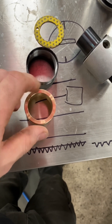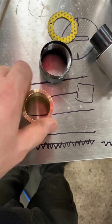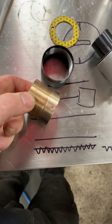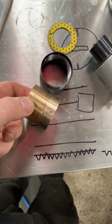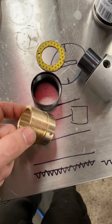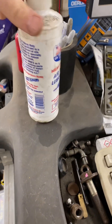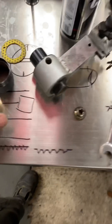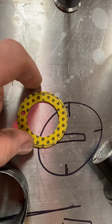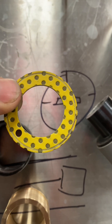I think I'm gonna put a bit of anti-seize grease on that thread. Now I know it comes apart I can always take it apart another day. It's quite stiff — I'll just put some light GT85 or something in there, a very light lubricant. Then I'll re-grease the backing plate that goes on there, since there's a fair bit of grease in there.